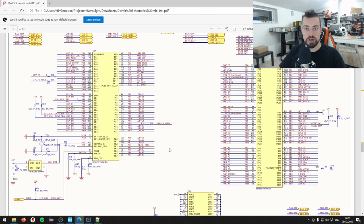Writing your own external loader is the right way - then you're not dependent on anything. ST says it should be easy to do. I personally haven't made that work yet - that's a topic for its own video. What I ended up doing: I was lucky enough to find a guy called Clive on the community forums who made several working external loaders. One matched my exact pinout since I was using the same flash as the discovery board - only the pinout was different.